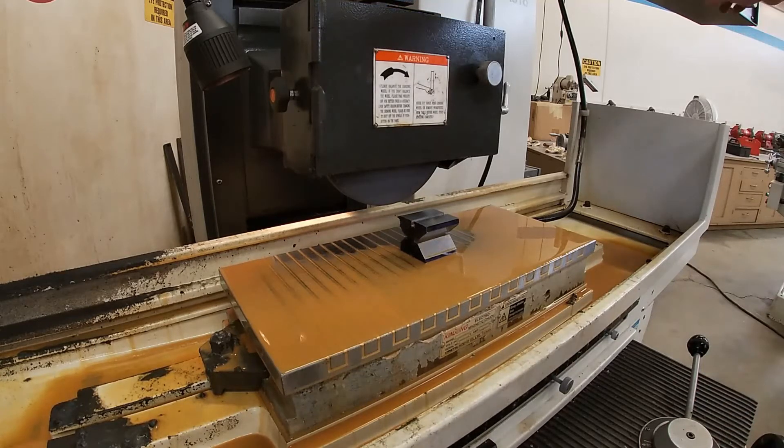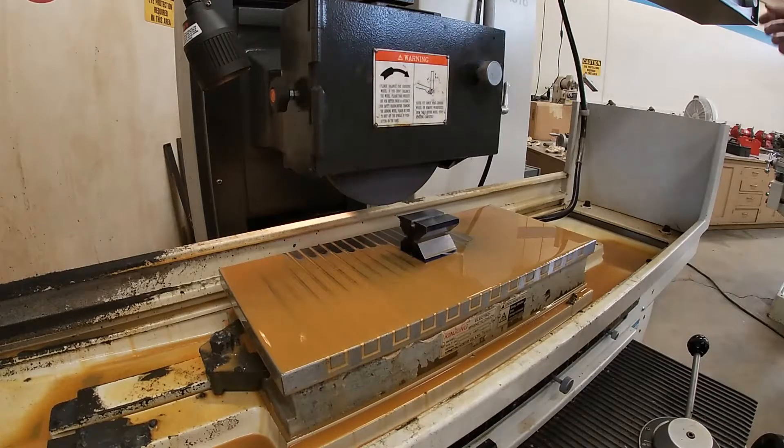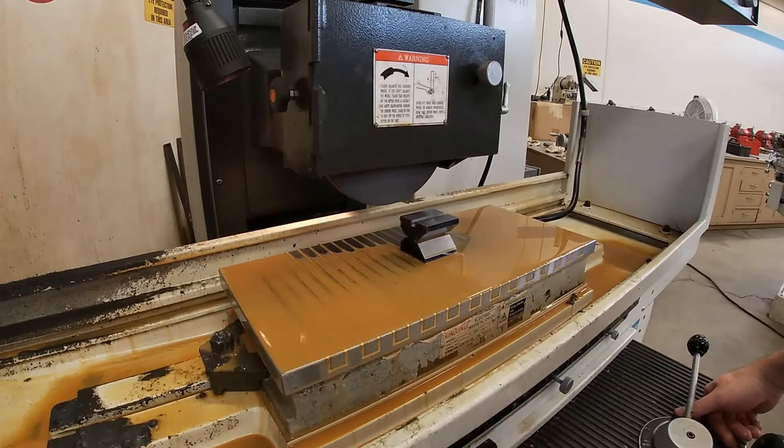After about 60 seconds I'll go ahead and shut it off. I am going to continue to run this grinder, but this is best practice — we're going to wait for the wheel to stop before we mess with the part. I just started the demag cycle. When this electronic magnetic chuck runs through its demagnetized cycle, the part will be easy to pick up off the magnet and shouldn't have too much residual magnetism in it.